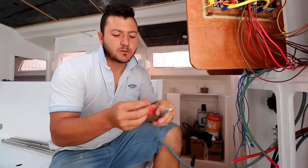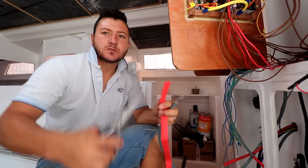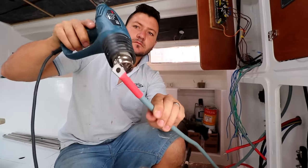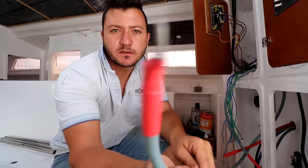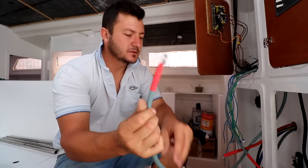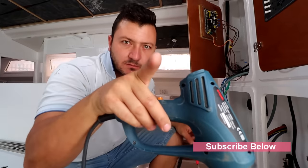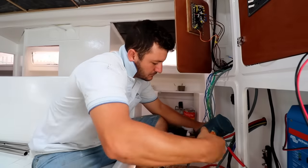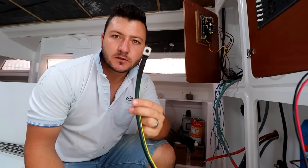That's what it looks like after the crimp. Now we're going to put some red shrink wrap over that. Once we've crimped it, we take one of these heat rings — it comes in a strip like this. Just take a pair of scissors, cut a piece off, and then it looks like that. Take the sleeve, put it over, and there it's done. It looks like that — then you know it's good. Right about now is the time to press subscribe. We did all the other connections as well.